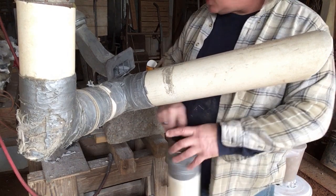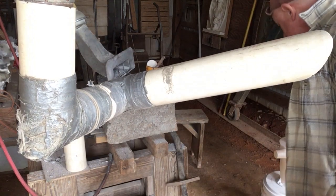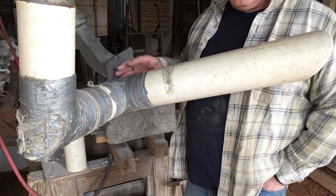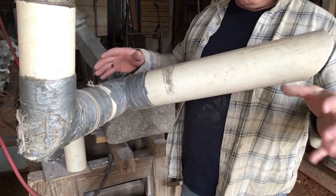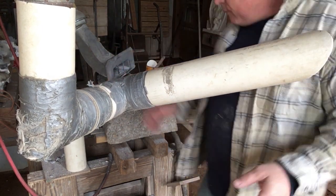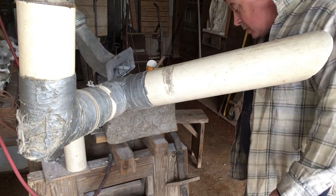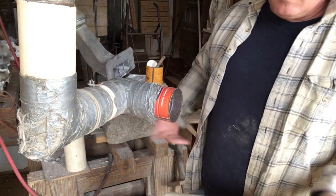Now, you can get a woodworking suction kit, with the big bags on them, and that's why I mentioned the Dust Deputy. I started my first couple of stones before I got my big torque machine or my torque portable. I just had a woodworking head that had two big sets of bags on it, and if you have that with a larger cyclone, it'll make a huge difference when you're stone carving, and then you don't have as much dust to deal with. The dust is also valuable depending on what kind of work you do.